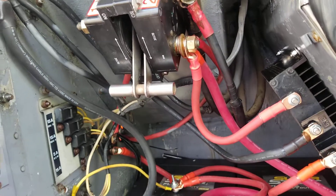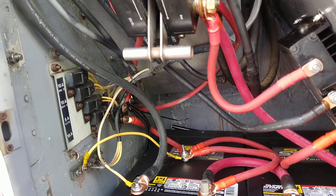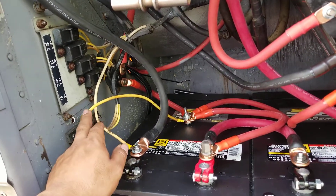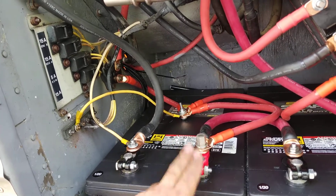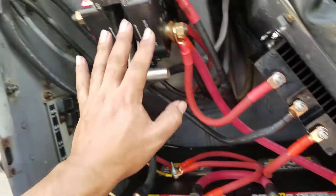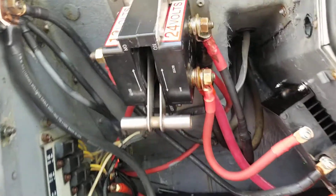Be careful with that. If you want to make sure there is no voltage in the coach when you're working on something electrical, you must disconnect this wire — it's got 12 volts. Other than that, the 24 volts are safe; there's nothing going past the cutoff switch.